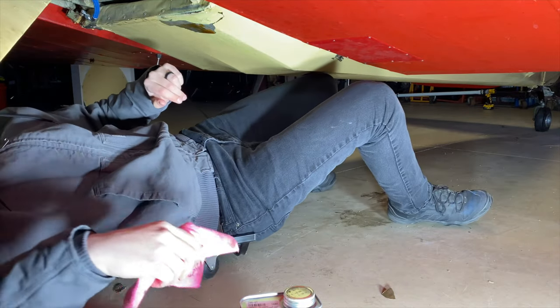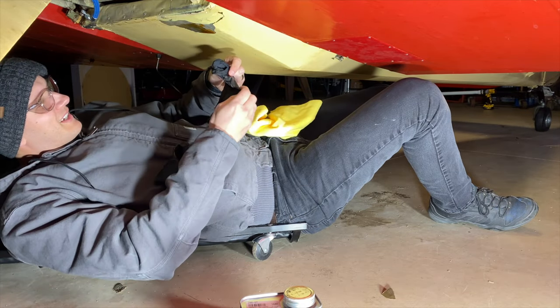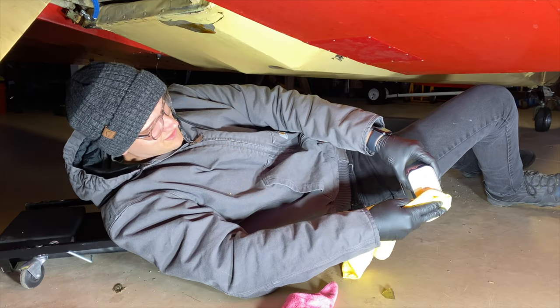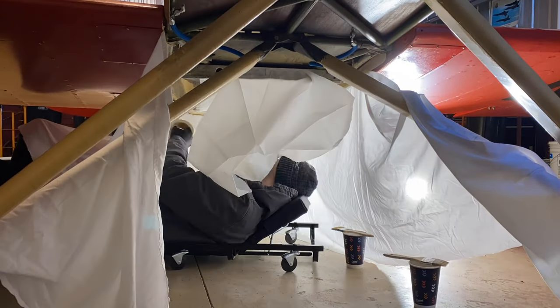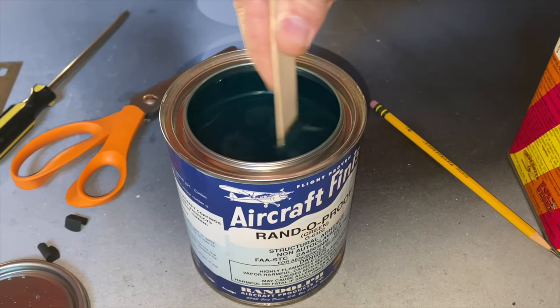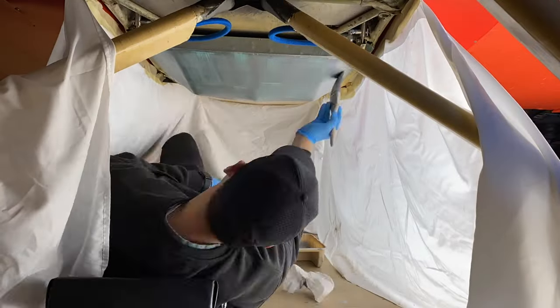Today we are starting under the plane. This area of the belly is very oil-soaked, so we're probably just going to do one big patch rather than individual tapes. We do not have heat in this hangar, so we had to build a little room to get the temperature correct for this fabric repair. After cleaning the belly and making a plan, Cliff made a patch, glued it, tightened it, and the multiple coats of sealer and silver UV protectant began.